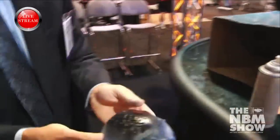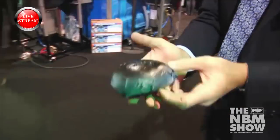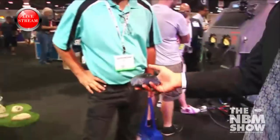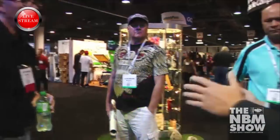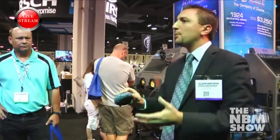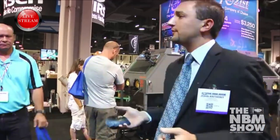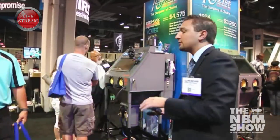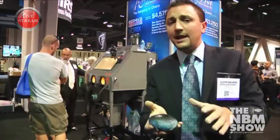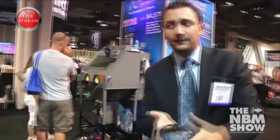I've got coverage on each side — a nice black, dark paint color — and my whole engraved area is painted. One thing I want you to notice is that there's no running paint here. If I were to turn this upside down, there's no paint that's going to drip down. The advantage of that is it's not going to peel up when I remove my photo mask, and it's also not going to fill that engraved area up so much that it doesn't look engraved anymore. When you're painting, you always want to have a clean surface.